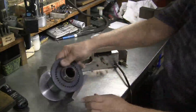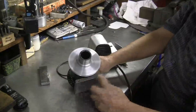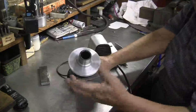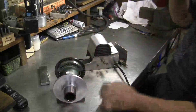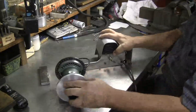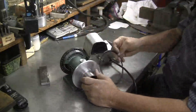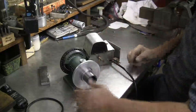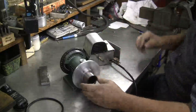The dimensions — I just laid out the holes on the spin index fixture and mine happened to turn out four inches and two thousandths. Yours will turn out whatever they turn out, so you won't really want some of the dimensions, for example the ones on the motor bracket bolted to the spin index fixture. It's real quick to take off — you just pop the O-ring off, take those two screws out, and you're back to a regular spin index fixture, ready for the mill or wherever.